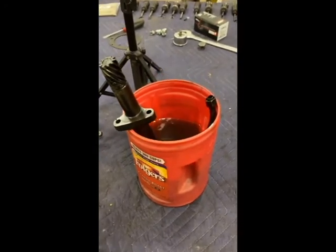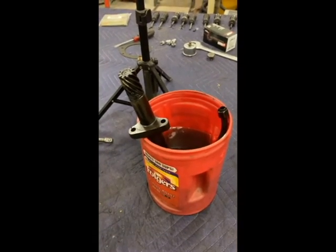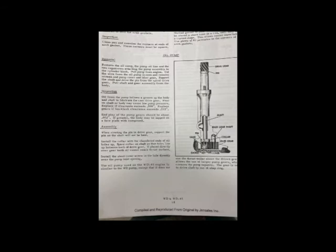Anyway, that's just a quick tip. We'll get back to installing it in the tractor. Hopefully I've given you a tip during your restoration projects on a way to test that oil pump. Not very fancy, but it's a good way to just make sure the pump's working. Running clean oil through it also allows you to clean that pump and the lines out prior to pushing that through your oil system and down onto your brand new bearings. Hit like and subscribe, leave a comment below, share, turn on your notification bell, and have a good day.